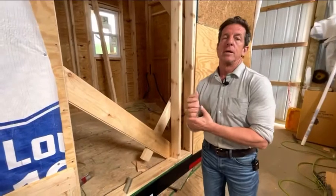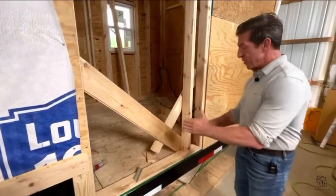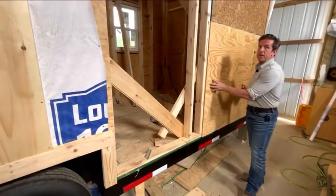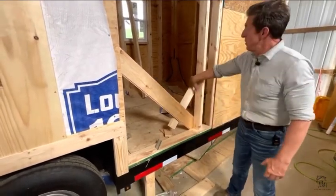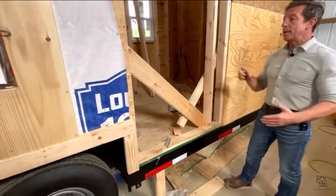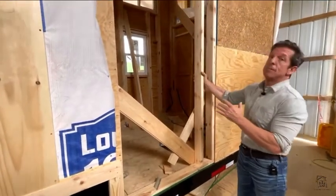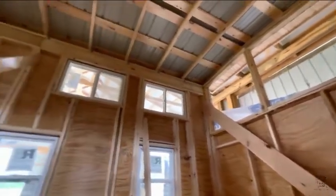Some people don't care — we've had about two houses where they would step down, and that's what they wanted. But this homeowner didn't want that. We had a 36-inch door we had to move because it was over a fender. Also, the tub shower — this is a tub shower going in here. It's five feet, and you have to have five feet. In an 8x18 they wanted a tub, so a tub shower is going in here. The plumbing is right here. If you have a 36-inch door, you can't get a 36-inch door in there. The tub shower is on order and coming in tomorrow morning. They can't finish framing because this stud is going to come out to get the tub in, then they'll put it back.